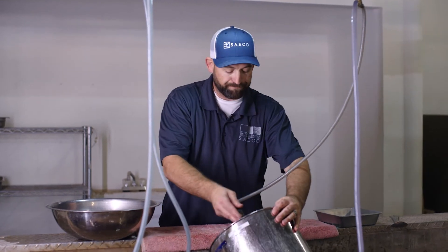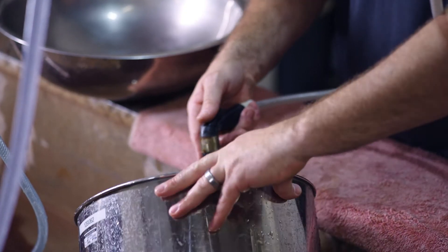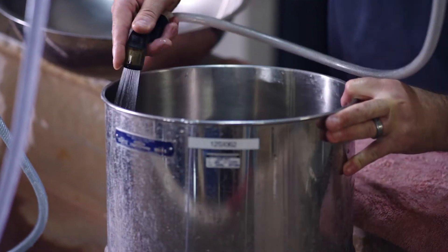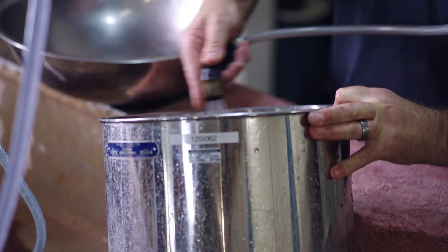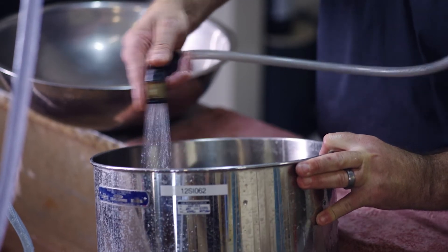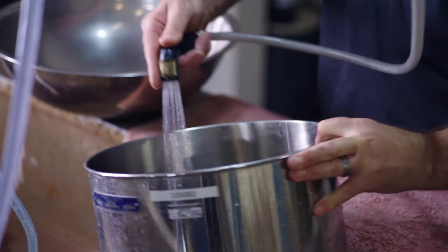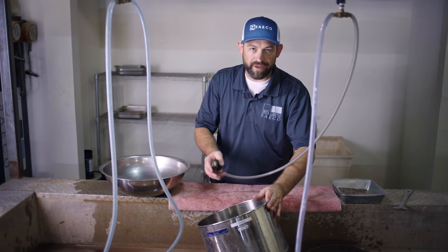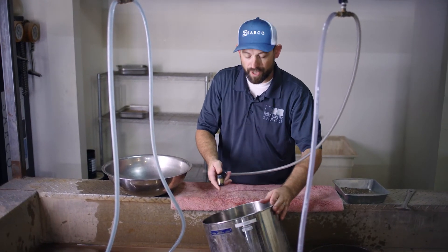The 200 screen is 75 microns — it's really fine, about as fine if not finer than a human hair. A clay particle is microscopic. A silt particle you can see to some degree, but anything smaller than 75 microns, the human eye is really not going to be able to identify any individual grains.